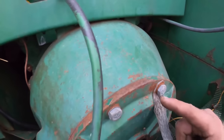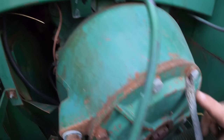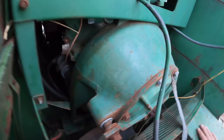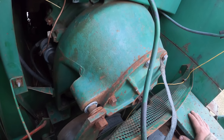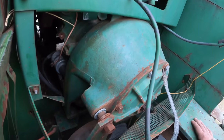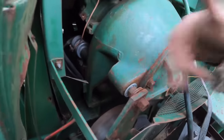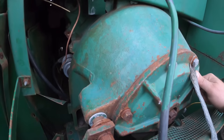And on it, there's a cast V-groove pulley that does your long traction drive belt that goes down to your variable speed unit. And then from there is the wide belt that it squeezes, and that goes forward to your clutch shaft and your transmission. So that's on the back position, and then the front position is your multi-groove pulley for your Thresher drive belt.